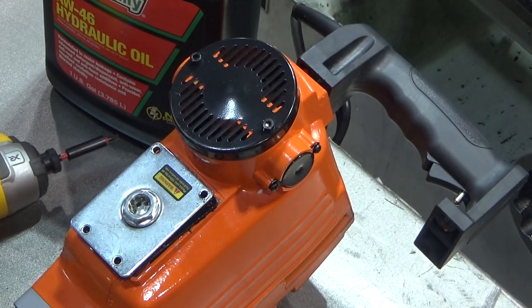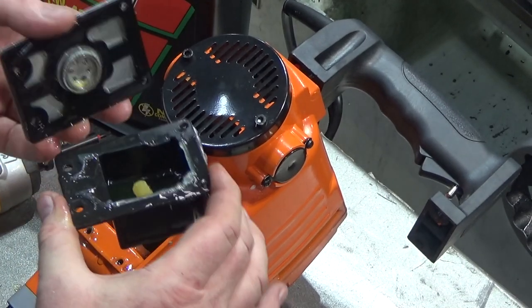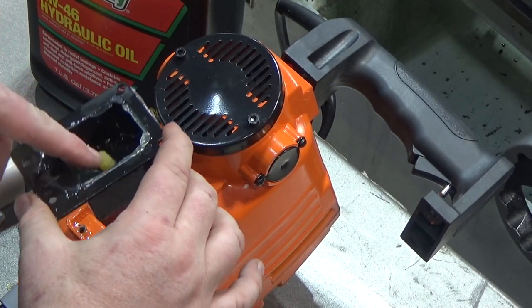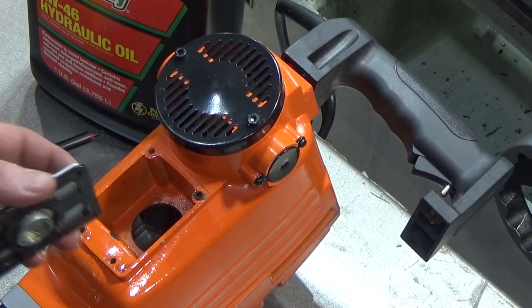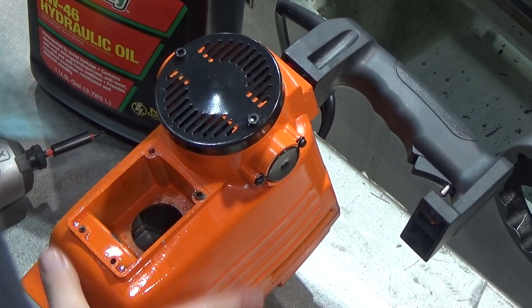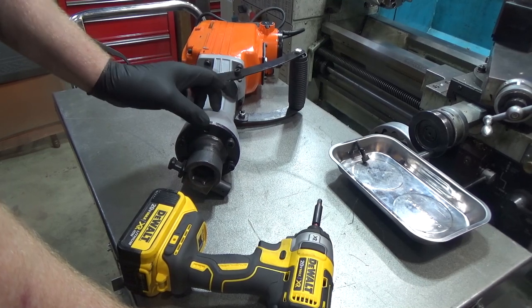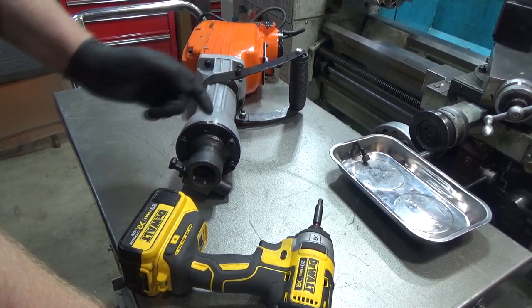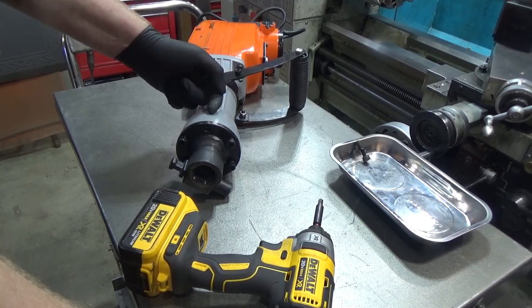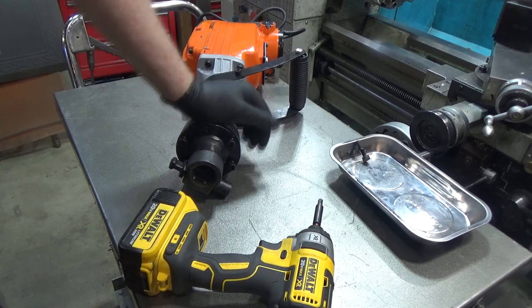After failing to get the top off, I went in through the oil cup. The manual shows that the whole cup comes out and lets you see inside. There was a tiny bit of oil — they obviously tested this in the factory — and you can see the wick running down the middle. The instructions say to pull the wick further in or out to allow more or less oil to drip into the main chamber. There was also some additional silicone sealer on the lid gasket. I believe the piston pushes air which pushes against a plate forward, with a return spring, and the key point is that the mechanical motor drive doesn't make direct physical contact with the tool — there's an air gap to cushion the blow, otherwise you'd probably destroy the motor and bearings quickly.